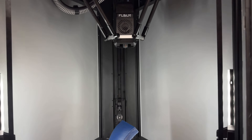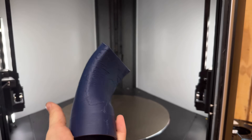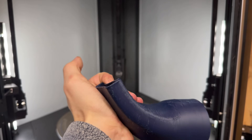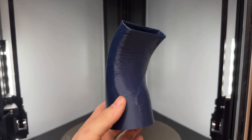Now that I've had a chance to try out PLA at 500 millimeters per second on the outer wall, I want to try something that's got a little bit of infill — 800 millimeters per second versus 500 is kind of an insane increase. Right off the build plate, adhesion was really good. Part quality — I mean, I can't really break it. Even in areas like that center it just bends. So 500 millimeters per second, 22 minutes — it's fugly but kind of works.